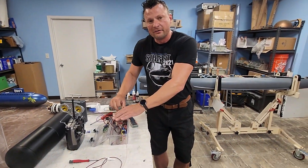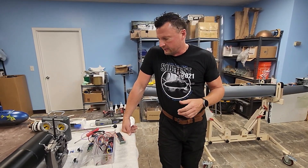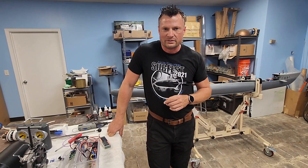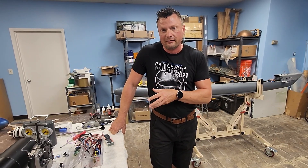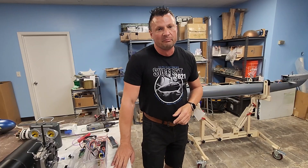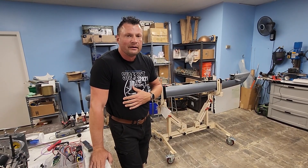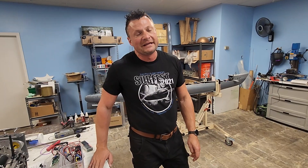So there you go — we've got sound in the boat, smoke in the boat, periscopes in the boat, lights on the boat, and radar on the boat. Now it's just a matter of tying it all together so we can control it all from the transmitter, as opposed to all these individual components and testers. Once this box is done we're going to be like 99% of the way there and we'll be moving on to wet testing. It's a long process but it's going to be worth it at the end. Thank you for joining me — please like and subscribe so you know when the next updates come out, and we'll catch you next time.